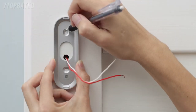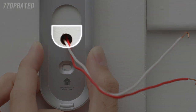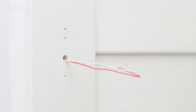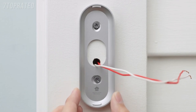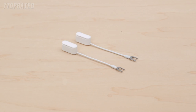Now you'll mark the screw holes with the wall plate — make sure the Nest logo is at the bottom. You may not be able to reuse an existing screw hole. The wires must come through the bottom half of the wall plate's hole; if they don't, they can prevent Nest Hello from locking onto the wall plate. Use the included masonry bit and wall anchors if you're drilling into stone, stucco, or other hard materials. Now attach the wall plate by drilling pilot holes with a 3/32nds drill bit, making sure the Nest logo is at the bottom and that the wires come through the bottom half of the wall plate hole. The horizontal screw hole will let you straighten the wall plate if needed — you can use a level to check that it's straight. Connect the wires to Nest Hello; it doesn't matter which terminal you connect a wire to. Make sure the wires point down, not up, so any excess can be tucked back into the wall. If the wires are too short, use the wire extenders that are included in the box.